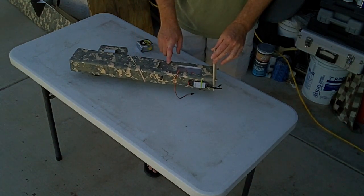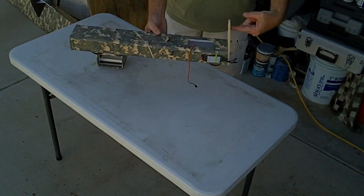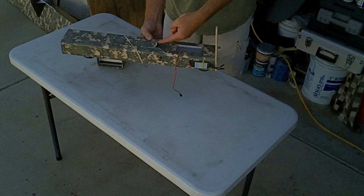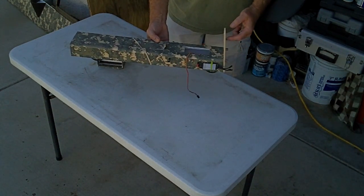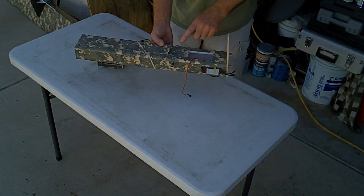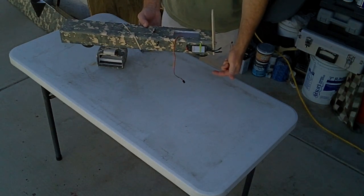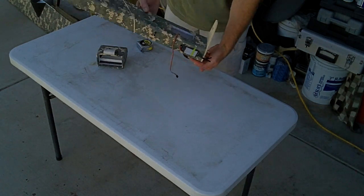And what that does is it compensates for thrust angles. So when the motor is up here above and it pushes the nose down, right? But when it's on an angle like this, it compensates by pushing below the nose and keeps it on a level flight. So when you power up hard, and this is straight up and down, it's 90 and it's some 4 inches above the pitch moment, then it will want to pitch the nose over. Make sense? Likewise, if the motor were down here and pushing parallel to the pitch moment, then it will push the nose up. Make sense?